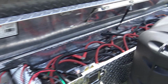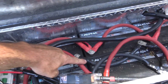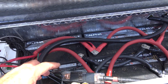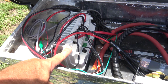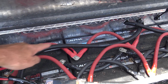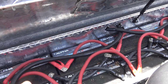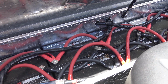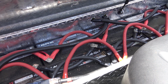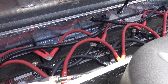All right. This is a 24-volt battery plant. I made all those connectors, jumpers myself, but sometimes I ran out of heat shrink, you can see. And the fuse I haven't mounted yet, but 250 amp fuse. So 72 volts coming into here, and then the MPPT drops it down to 24 volts, which is 12, 12, 12, 12, 12, and then another 5, 12, and then I ran both banks of 12 in series for 24. I have about 400 amp hours at 24 volts. That's 80 per battery times 5 is 400 on each side, then I ran them in series.